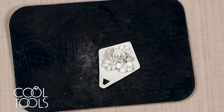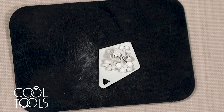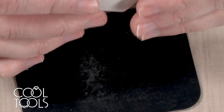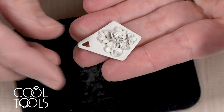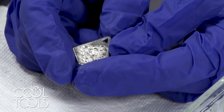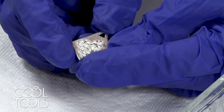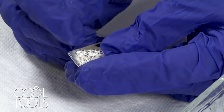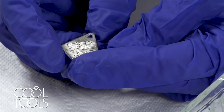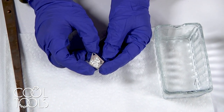Since I was working with FS999, I'm going to full ramp my kiln up to 1650°F and hold for two hours. Since this piece has a nice flat back, it's an excellent candidate to be fired directly flat on a kiln brick. Here's my fired piece — I briefly tumbled it and you can see how those top edges shined up even though I didn't spend much time sanding them. The lower areas were a little more difficult to reach, so this piece is an excellent candidate for using patina to darken the low areas and add some contrast to the texture.